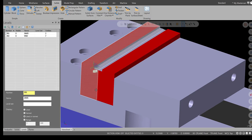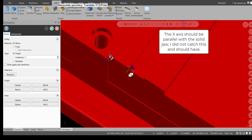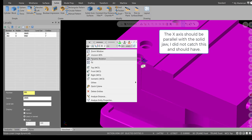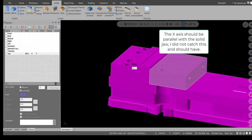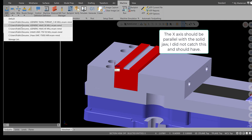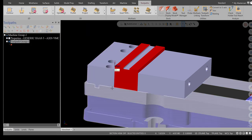Levels look good. Grab the entire vise and move it to the outside edge of the jaw — actually contact it. Snap carefully from here to the top plane, hit green check. Go into the Planes Manager, make sure they're all selected, hit Top and hit Equal to make the top plane active. Clear colors — now we're ready to machine this vise. Go to Toolpaths > Machine > Mill > Generic Haas 3-Axis Mill. Good time to save — I'll call this Example Mill Part 4 on the desktop.